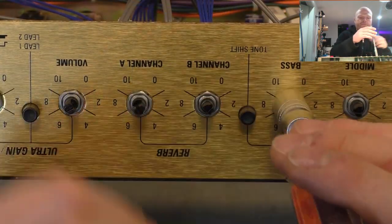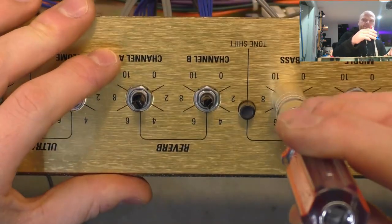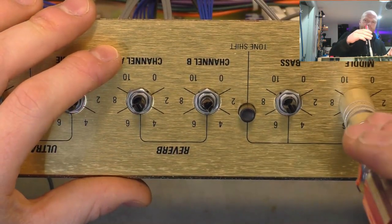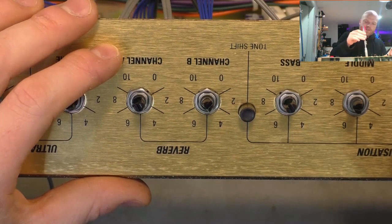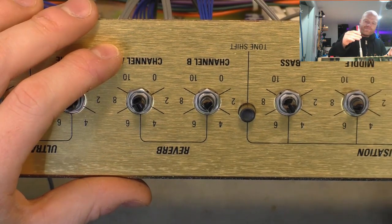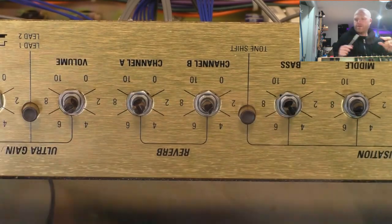So tightening these up, we don't want to give them too much, so just on the screwdriver. Don't get your wrist on it. Just how much torque you can offer with, say, two or three fingers. It's about right, but not so loose they're almost going to come off by themselves like when it came in.